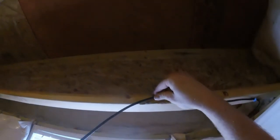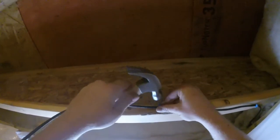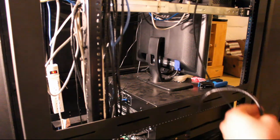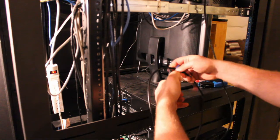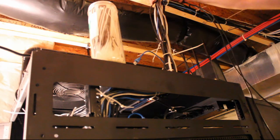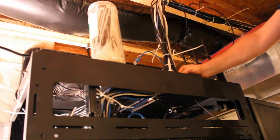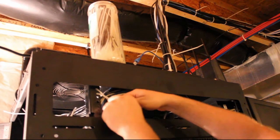Now back inside I need to run the cable to my home automation rack and the NVR. I'm using cable staples to secure the cable in place until I get to a cable bundle, at which point I switch to zip ties. I measured how much extra cable I need to get to the NVR once inside the rack and cut the cable off my cat 6 spool. Once I have the cable cut off I can route it into my rack along the path of all the other cables entering it. I'm still using zip ties to secure the cable in place and I left myself a couple extra feet of cable as a service loop just in case I decide to move the NVR down in the rack at some point.